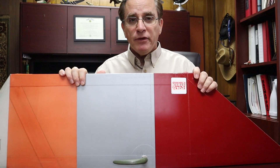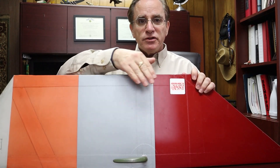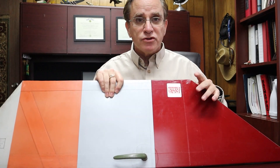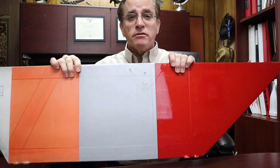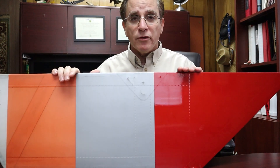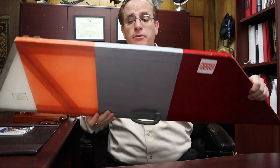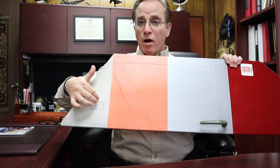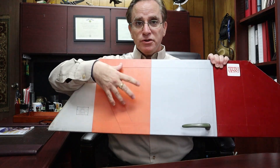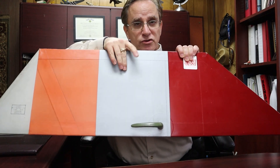If you can, put the component in the sun, then come back with a maroon Scotch-Brite pad, scuff the surface, and shoot on three coats of poly tone — or three coats of the shiny stuff, called Aerothane, or another option is Ranthane. So that's the whole system — the Poly-Fiber system in a nutshell: raw fabric, a brush coat and two sprayed coats of poly brush, three cross coats of poly spray.